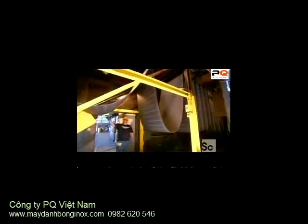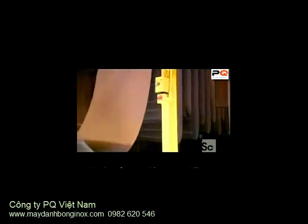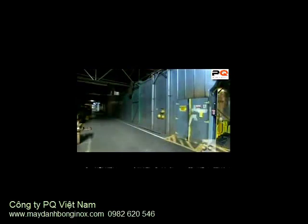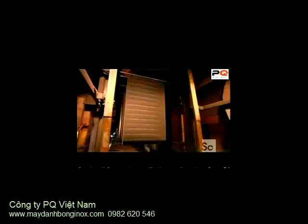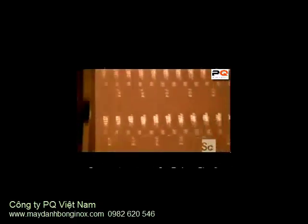This production run gets the go-ahead, so workers move the sandpaper through a 100-yard-long oven. It has 3 different heating zones, each progressively hotter. The increasing heat bakes the grains into the adhesive. The sandpaper is now rough enough, but it's not quite ready for use.